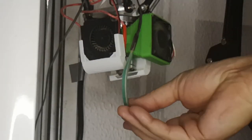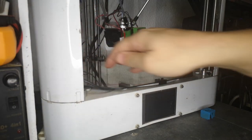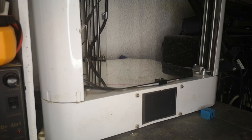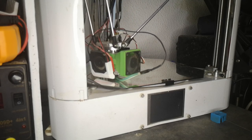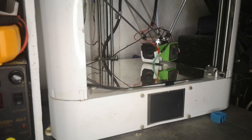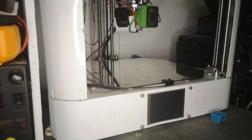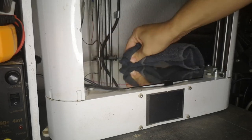This video took a long time because my 3D printer failed three times during filming. First the heater block failed - the heater element - then the firmware failed so it just turned off randomly. Finally one of the wires burnt internally so I couldn't see what was wrong, but power wasn't getting to one of the fans and it shut itself down. I'm keeping the wires off - I have one of these probes that senses when the head touches the bottom. I notice the hanging wire can get tangled up so I have to help the printer. I think there's something wrong with the tower on the right - the limit switch is moving when it homes.